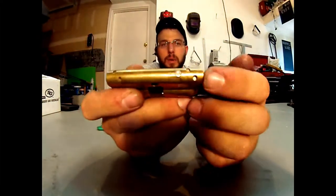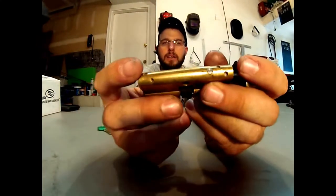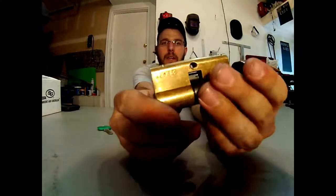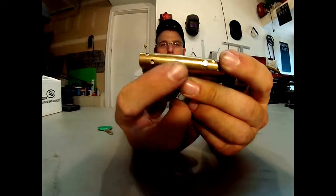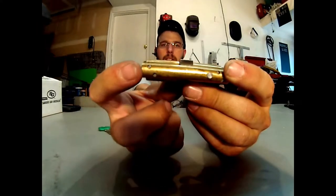Originally, they had a fairly good design — they had anti-drill pins here, here, and here, and then from the outside here and here. It did have a code stamped on it, but these things couldn't really be re-keyed anyway because there's nothing in the top cylinder to take out to be able to remove those pins.